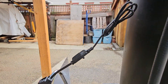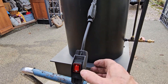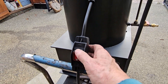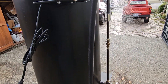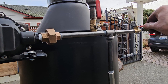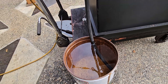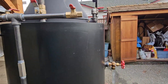I'm going to turn on the switch to the pump. Always keep this cord away from the firebox and the boiler — it'll melt if you don't. It's pumping all the air out of it now, and now everything that's pumping is going into the boiler. You don't want to put too much in at a time — it'll kill the steam.